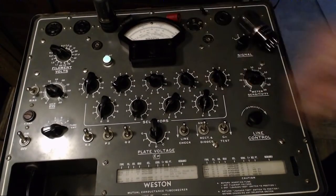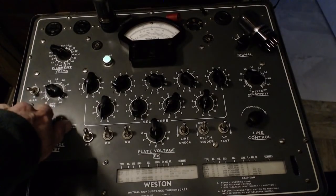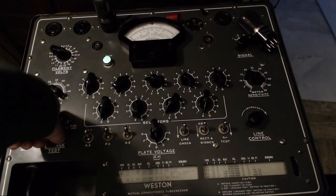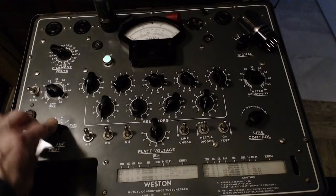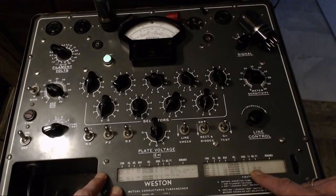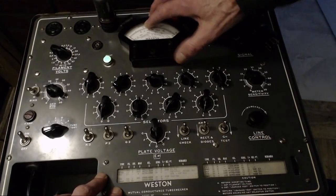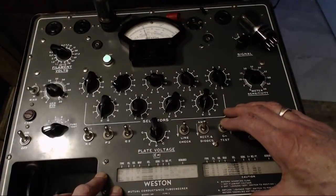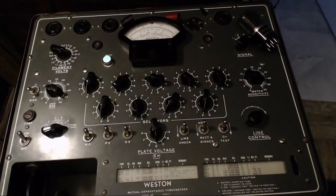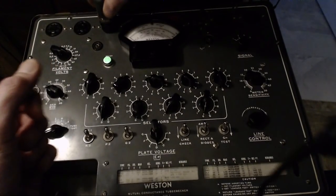Okay, I can see it heating. Of course, we know these tubes work. Now, maybe one of them has a short, and that's where that hum is coming from. So let's look. This is a good tester to look for shorts. Nothing showing up on this tube. Okay, and let's see, the mutual conductance should measure at 990 on the scale there. Okay, so right, 990, right at 1,000. Bingo. So this guy, now that's the rejection point. So this test is showing that tube to be near the end of its life.